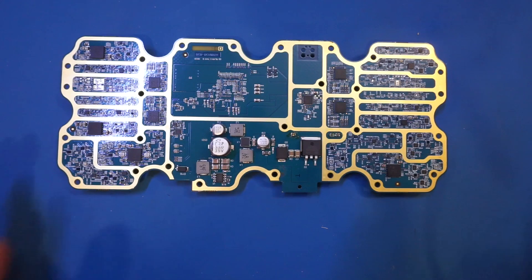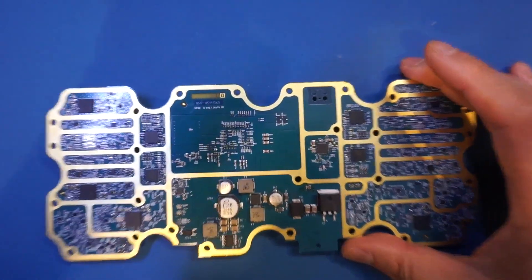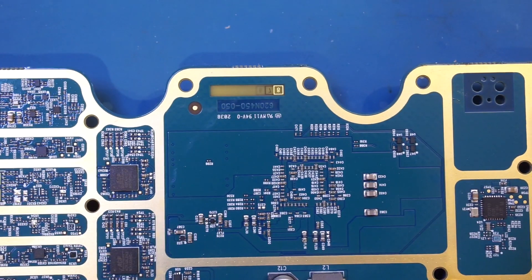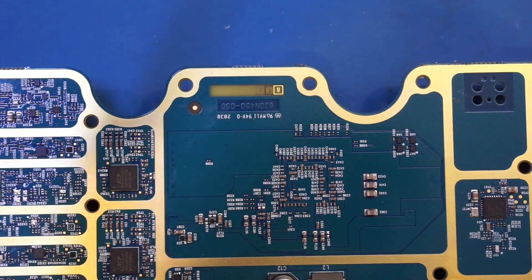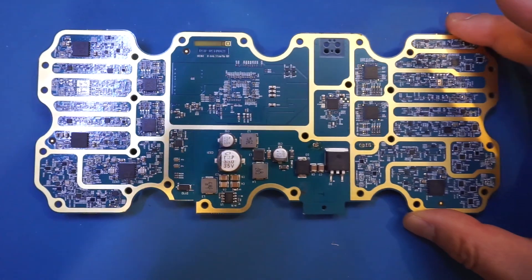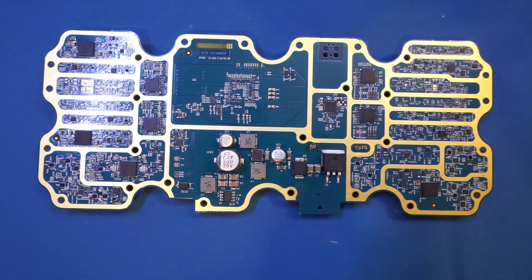And by the way, we know that this is a multi-layered PCB, but now you can see from the marking here that this is actually an eight-layer board. Obviously, the more layers you have, the more expensive it is to make the board. For a board this size, even in volume, it will probably cost around $10 a piece just to make the board itself. Given the complexity and the large number of components involved, you can certainly appreciate why a signal booster like this one costs more than $800.